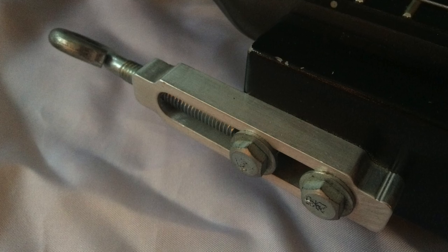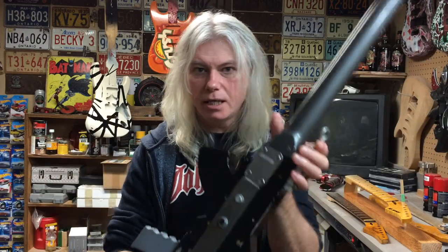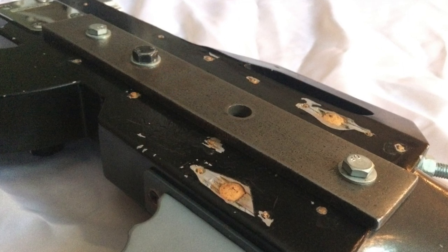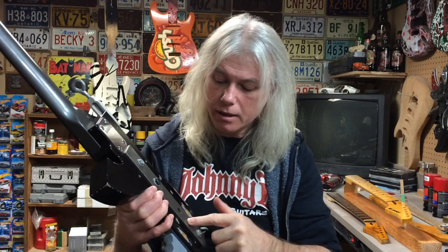It works in a way that I could screw it to the body, secure it nice and tight, and it's adjustable — it could give me a lot of space outward to help balance. The other thing I did, which is really significant and has affected how I build guitars now, was I had this piece of quarter-inch flat bar hanging around the house. I thought if I screw that to the back of the body you won't be able to see it, but it'll add weight. So not only had I brought the guitar strap forward, but with a little extra weight to the body it might work.